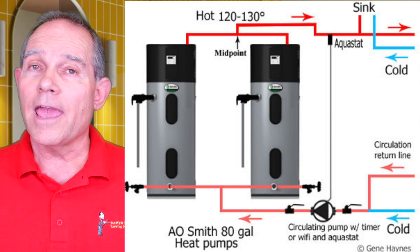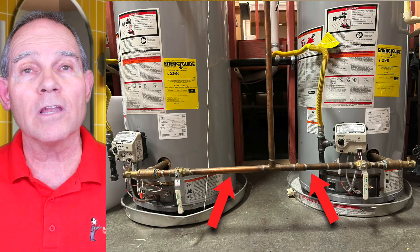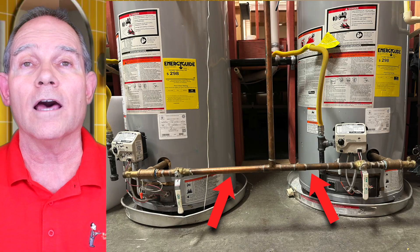So I still like series, but our inspectors around here say I can't do that anymore. We put all our water heaters in parallel now. With parallel, you have to make everything exactly the same — or as close as you can get — going into each heater: the distances of pipe and everything. With a recirculating system on parallel heaters, we have two options. We can tie it into the drains at the bottom of each heater, evenly and in parallel, just like we tied in the cold and hot lines.